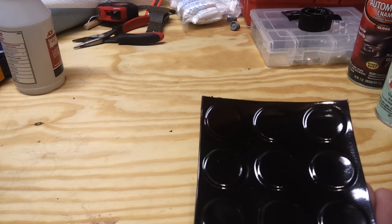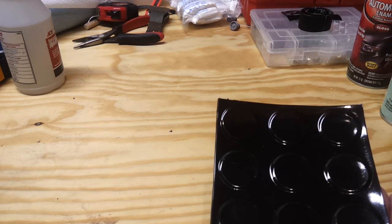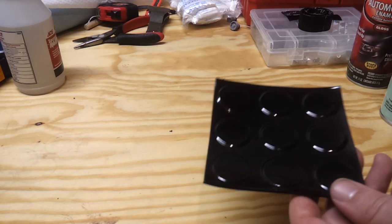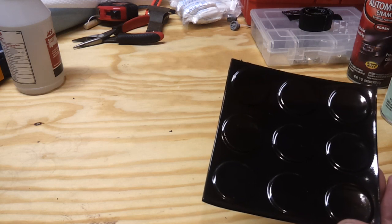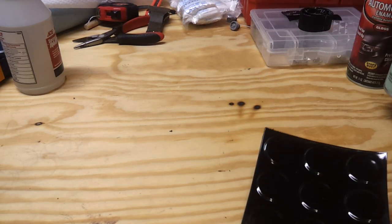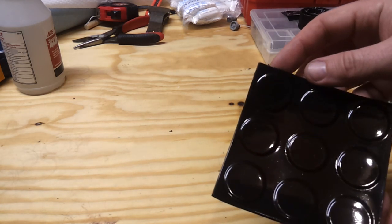I was done very fast compared to the auto-enamel — I had six coats on in less time than it took for three coats with that. Just to let you know, the Krylon Fusion does come across as a milky white after you get the coats on, but that clears up after 24 hours, and it does mention that on the instructions.